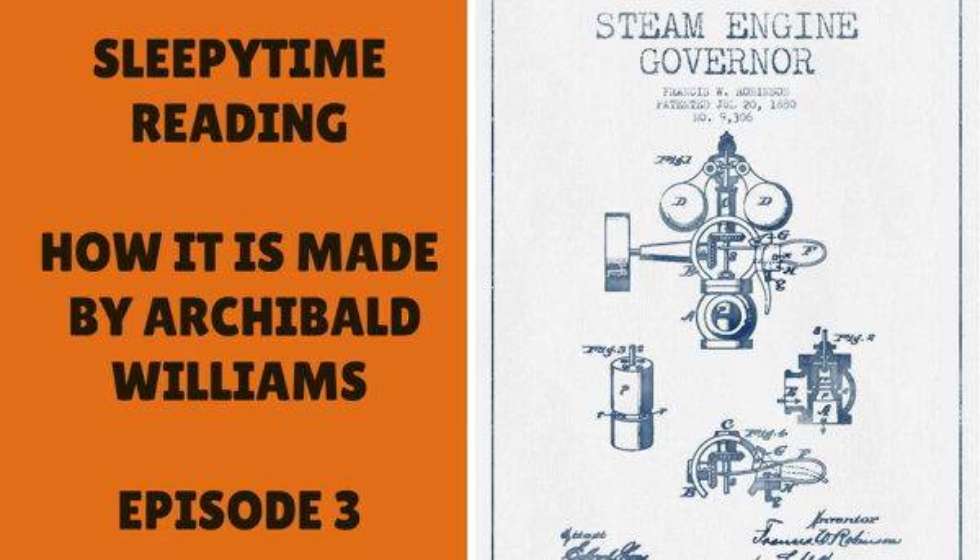Messrs Bryant and May are now introducing a machine for making square matches by the same process. In the same room is a wonderful machine forming box covers — the outside or case of the box. Out of a long ribbon of cardboard, the mechanism scores the strip longitudinally in four places where the bends will come, glues one edge, doubles it to form a continuous rectangular tube, prints any required design on the top and bottom, glues one side and sprinkles it with ground glass to make the striking face, and chops the tube up into covers at the rate of about 800 per minute.